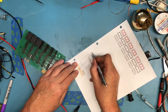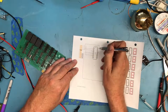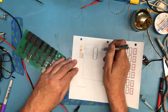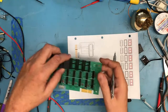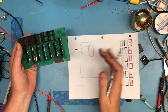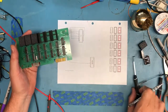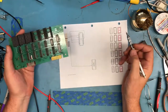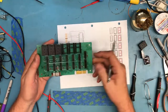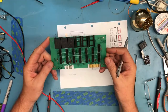So as I'm drawing these connector lines in, I'm also trying to leave lots of white space here so I don't have to erase and move lines around because it gets too crowded. Again, that's just kind of thinking ahead. Hopefully at this point you've already captured the fact that some planning and thought ahead of time makes reverse engineering something like this easier. This is a pretty simple board, but even it's taking a bit of thought to get through.